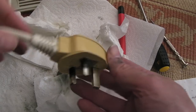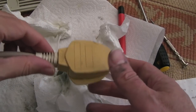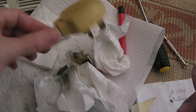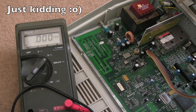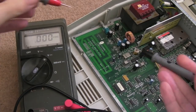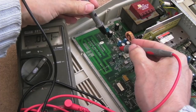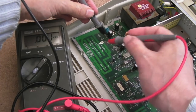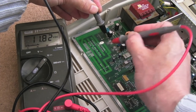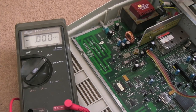We'll clean the external part of the plug later, but you can see it's leaps and bounds better than it was. I'm going to plug this in, switch it off first, plug it in, then switch the socket on and see what happens. So plugged in, I'll switch it on - well, nothing popped. Let's just measure between the contacts: 5.11 volts - can you see that? We'll check the other voltages as well: plus 12 down here, minus 12 down here. So in terms of supply rails we seem okay.